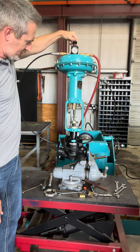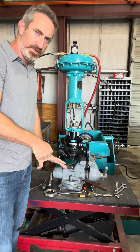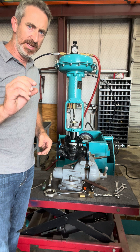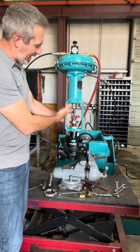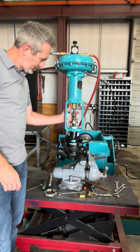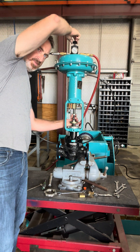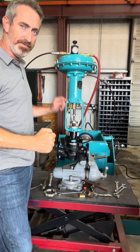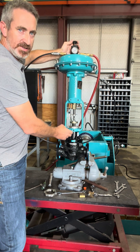I'll stroke the actuator up, because as bad as you think you've shoved that valve and you felt it tonk into the seat, a lot of times when you tighten that packing or do anything it'll lift it up just a tiny bit or sometimes a lot. So what I like to do is stroke the actuator stem up a little bit, spin your jam nuts up until it hits, and then let the air off the actuator. Now I know it has physically forced that plug into the seat — you can tell by the indicator it's not flopping anymore. That's as tight as it can be.